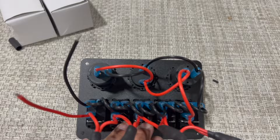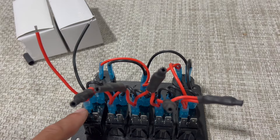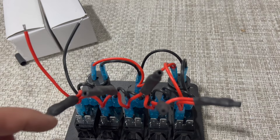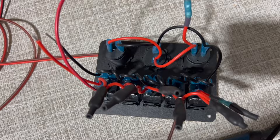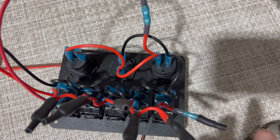My next thing I need to do is to get rid of the connection from right here over to my chargers and my voltage gauge, because I'm going to jump this post over to power all three of these. So I'm going to go ahead and just snip that, cap that off, make sure power can't jump. Then we will wire this post over into where I cut here to supply power. I snipped this wire that was connected across to my voltage gauge and chargers, capped it with a butt splice and some heat shrink so nobody touches it.